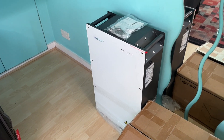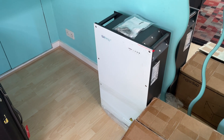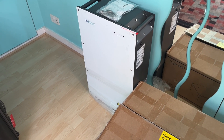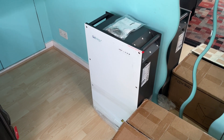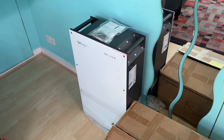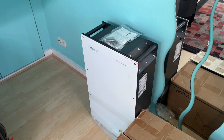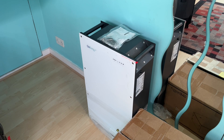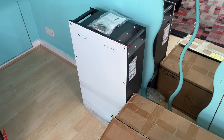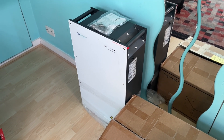I've spent all afternoon on the phone to GivEnergy and the distributors to figure out what's going on with these cables. GivEnergy says the batteries are not supplied with any cables. I asked how to connect it up since they've got a proprietary connector — an electrician or installer can't just improvise with any bit of wire. I called a variety of distributors and as of today most are unaware that this special cable is needed, or they're not willing to help get the accessory for me. GivEnergy doesn't sell directly to retail customers — only to wholesalers.